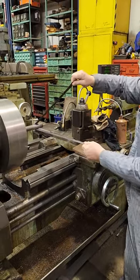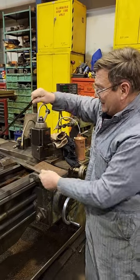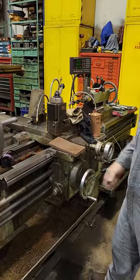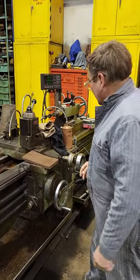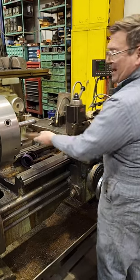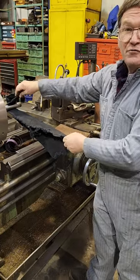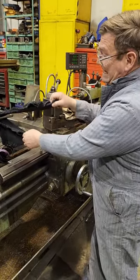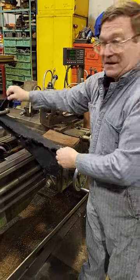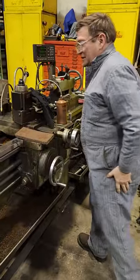I notice I'm not bearing down very hard on the end here. Also, when you're done polishing on the lathe, you want to wipe your ways down — there's going to be grit there. You can use Scotch-Brite again, though this is more hazardous; keep the contact down so it goes away from you. Another thing that's been used is just any old rag — wrap it around, use some buffing compound for real polishing. Hold it so that it will go away from you; don't get up close to the chuck. Leave yourself some room so it can go away.